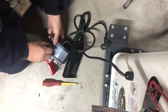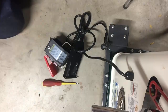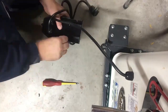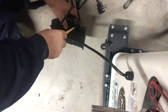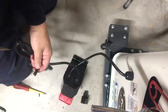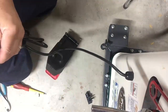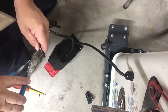If you want to replace the whole wiring assembly for the plug, you would do it before or at the same time as switching out the breaker. When you take the breaker out and unplug it, take the whole wiring assembly out, but you'll need the connectors to do it. That's the reason I didn't go with the assembly — the black wire has to slip back over the breaker, so I just clipped off the end of the plug and stripped back the wires.